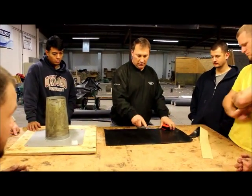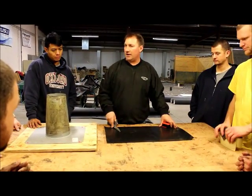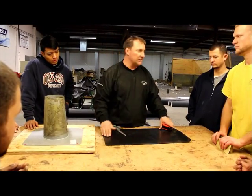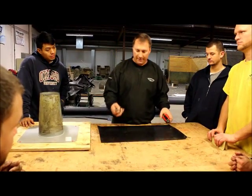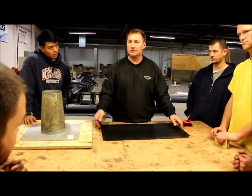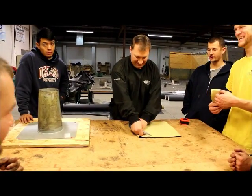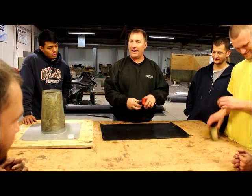So we've got our bottom, we've got the height of the pipe, and now we've got to get our measurement — or the cut — for the top of the ramp. So we need half of the 22, because what we have to do is make our banana cut. Half of 22 is 11. So we're going to go 11 off of our line.